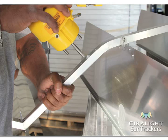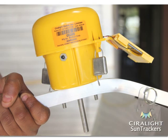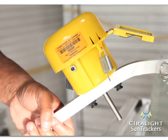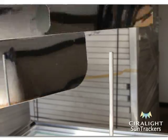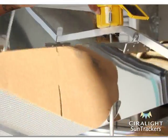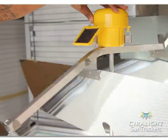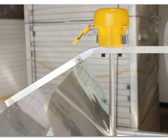Take the GPS controller and slide its three posts through the top of the mirror bracket's center three prefabricated holes. Position the solar panel of the GPS controller towards the small mirror. Secure the GPS controller to the mirror bracket by tightening one thumb screw to each of the two screw posts protruding from the bottom of the GPS controller. Take the entire triple mirror array and slide the D-shaped GPS post inside the D-shaped hole at the top of the vertical post. With the triple mirror array, make sure to slide the post through the hole in the middle sized mirror before placing the array upon the post.